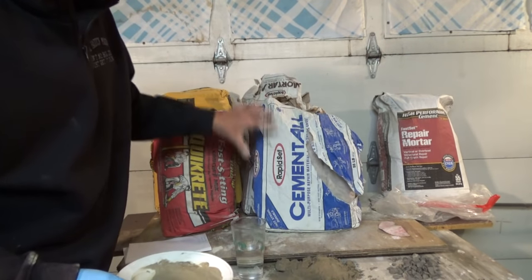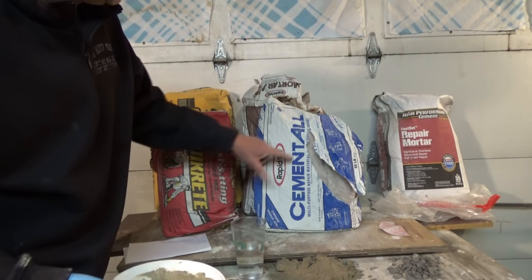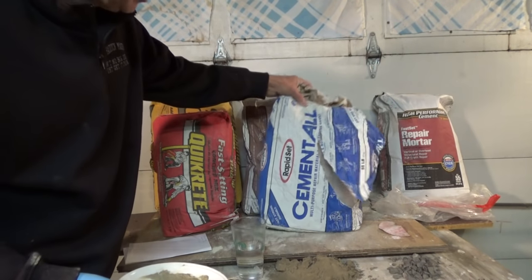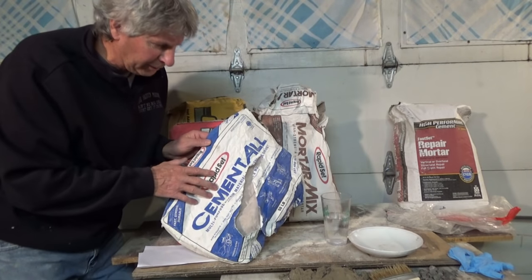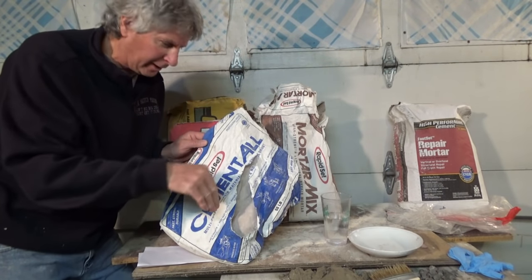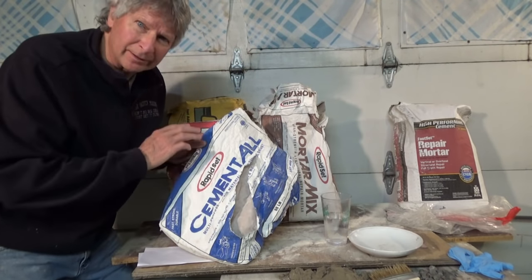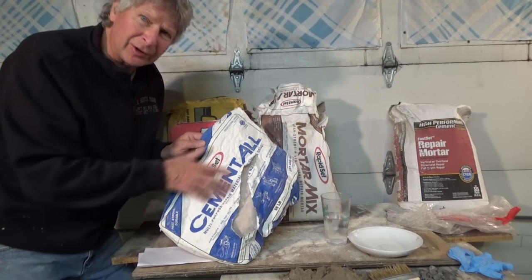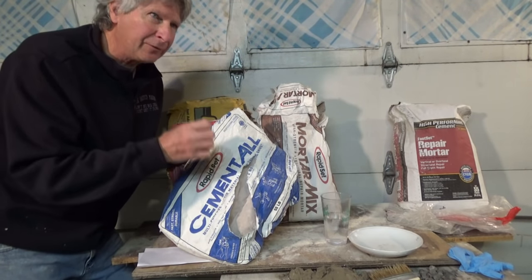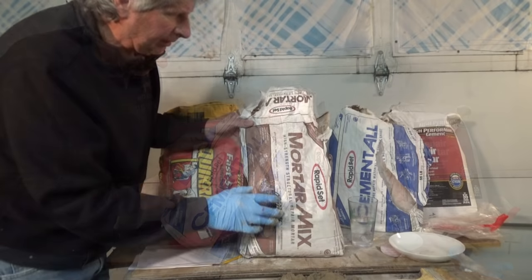The Air Force came out with Rapid Set — the reason they made this fast drying is because when they wanted to land planes in bombed-out areas, they could put the cement in, it dries really quick, and they could be landing planes on it. The highway department uses the same stuff. I use this for iron railings because it's gooey and it seeps down in there. I do not use it as a paint like Portland on a driveway. The winter will cause havoc on thin applications, but it's great for iron railings, bolts, and things like that.